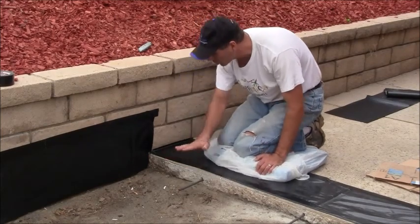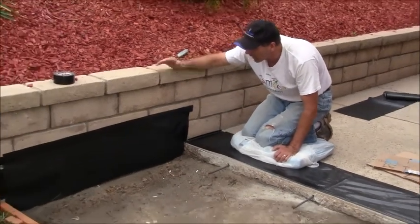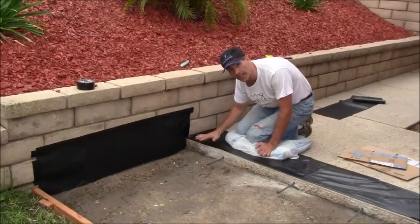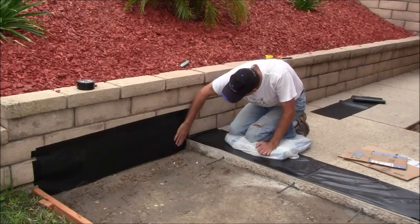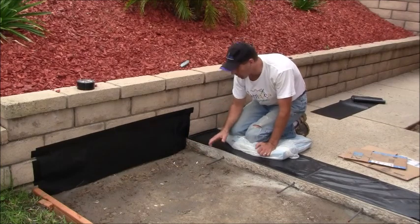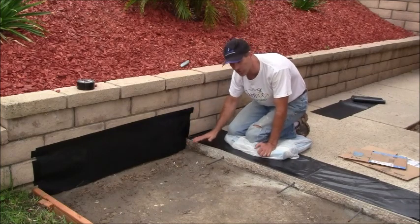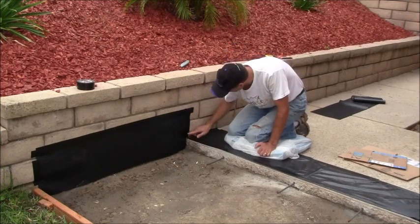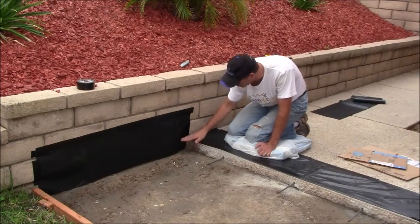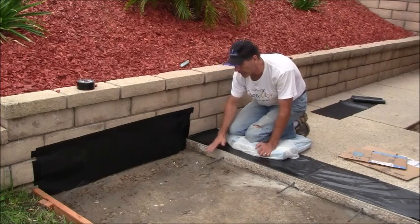Now this is on two horizontal slabs, one next to one another. Here, you have a wall which moves differently than this right here. So I put the plastic coming down into where the cement is going to be poured, because I don't want the cement to stick to this wall. So my intention is to pour the slab. It's going to come up flush with this level here, so it's about 3.5 inches down from here down. And then I'm going to leave the plastic in place, and I'm going to finish my concrete,